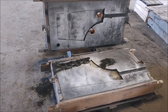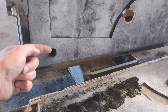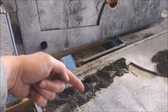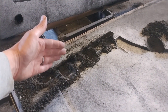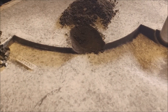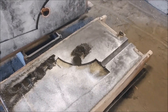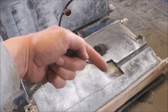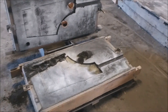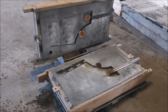Here's our mold and we've split the mold — we've taken our pattern out. Right here is where he's going to pour the metal in and it's going to run down along here. He's gated it in one, two, three places, so it's going to fill up this channel and run into the gates and fill up our pattern. This other little gate goes up and matches with our riser. Right here we'll lay the shaft down in the slot — it'll protrude into the mold about two or three inches and the brass will cover the shaft. Now we've got our post in there and we're ready to close up the box.